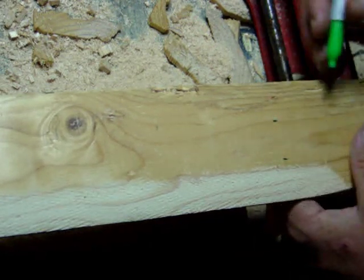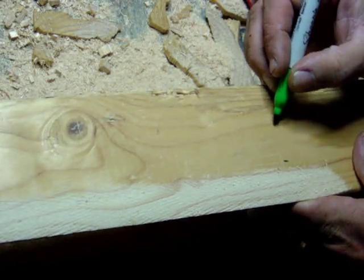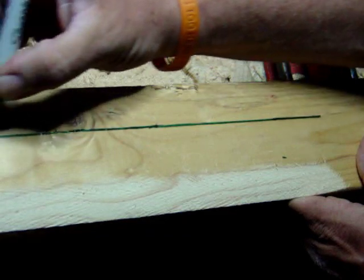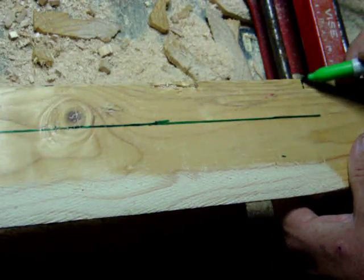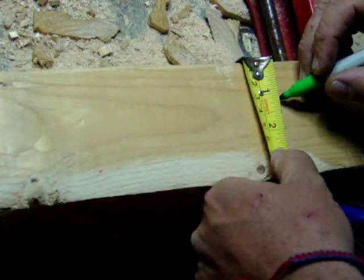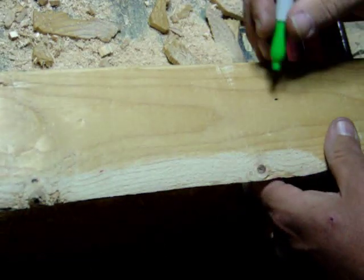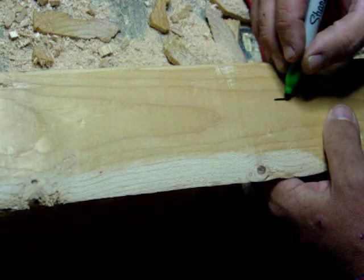A good way to draw a line like this: find out where you need to start your line. If you hold your finger to hold your tool like this, these two fingers should ride the side of the board. Freeze your hand and just draw it straight on down the board avoiding splinters. While you do that, don't change the angle of your hand — don't go like this or like this. Keep your hand exactly straight. I'm going to draw where my curve should stop. I'm going to do the same thing on the other side and draw one and one-eighth right here. That's a good mark and we should start from here — looks good.